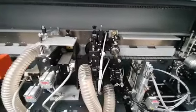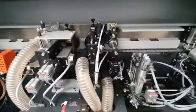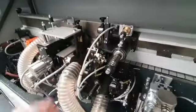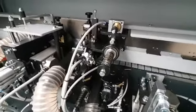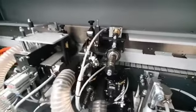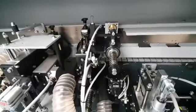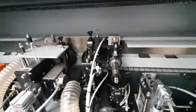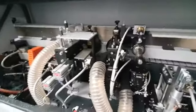Because we can adjust the trimmers automatically, we can also specify the machine with automatic adjustment radius scrapers, switchable between one millimeter and two millimeter radiuses. This means we can change from one millimeter tape to two millimeter tape and put a perfect radius on the edge of the panel — all adjustable from the front end touchscreen control. This is a really nice option and one that you don't see on many other machines.